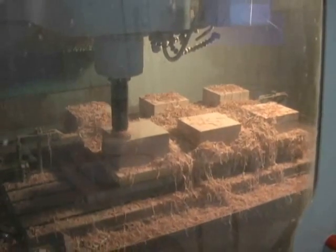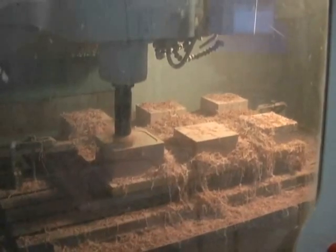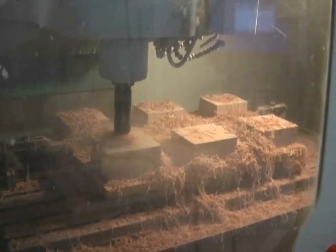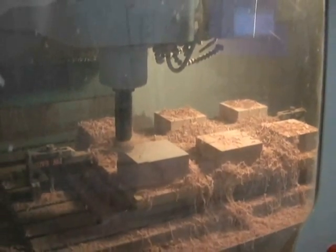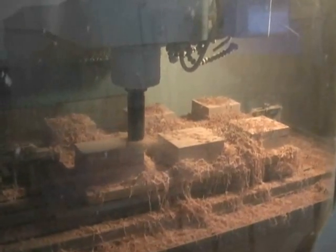As you can see here, we are well underway. We have a basic fixture that's meant to be an inexpensive, quick solution to a short-term problem our customer is having with their injection molded part. Our fixture is going to be made from a piece of MDF board — the actual plate or base of it — one and an eighth inch thick and roughly 20 inches by 30 inches. We took some scrap leftover REN board, actually a modular OBO as far as brand goes, bolted it down in some rough blocks that we had, bolted it down in approximate locations, and then are beginning to square up the blocks. We'll be machining the appropriate detail to indicate and fixture the part and then also hold the part down for our secondary machining ops.